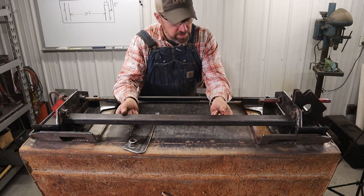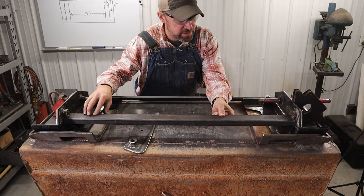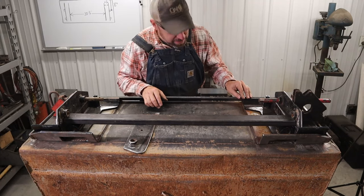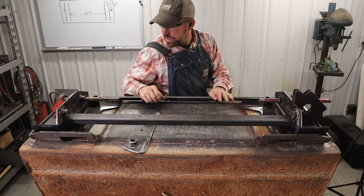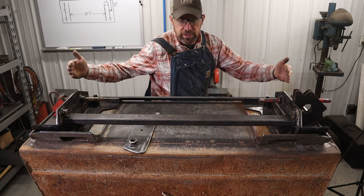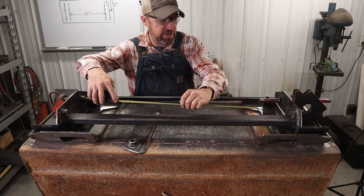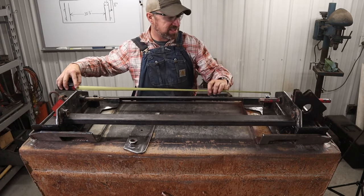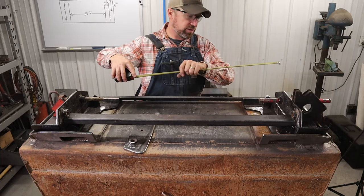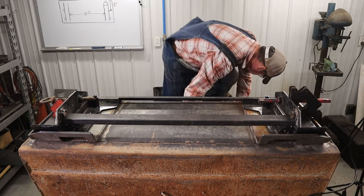I started out by taking this 1 inch by 2 inch piece, and I had it cut to 35 3/4, the distance between my weldments. I just encourage you to measure twice, weld once. I'm gonna tack it all together first and make sure I'm happy with it. So I think I've got these in place. I've got the quick attach mounts. I made sure that they were down flush against the bucket, and I made sure they were square on the edges so that hopefully our weldments are straight. I've got this piece in place so that I know my distance is good down here at 35 3/4. And then I want to have that same measurement up here at the top. Ooh, it looks like I'm a little short right there, so I'll have to spread that out a little bit. That's why we measure twice, weld once. All right, I'm going to tack it before I bump it again.